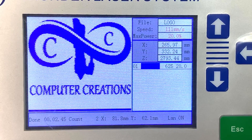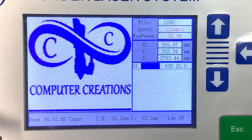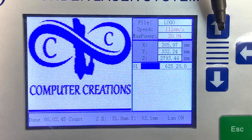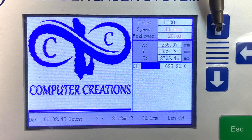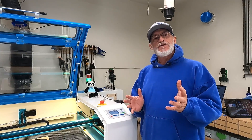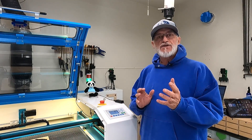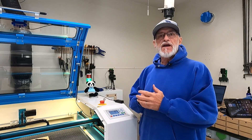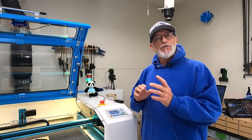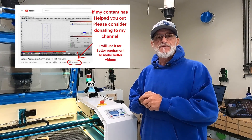Same thing here - we've got our current layer speed and power, and those are about all the areas that I use. On the newer controllers, the up and down arrows are your Z adjustment or bed height, so those would lift your Z or your bed up or down. As you can see, with just a few simple steps you have the ability to change not only your speed but your power as well on a file. Once you have your settings dialed in, record those settings, go back to LightBurn, plug in the new information, and you're good to go. It saves you a lot of time. I hope this information was helpful. I'd really appreciate it if you guys like, subscribe, and if you enjoy the content on the channel - big thanks. Until next time, thanks and have a great day.